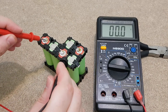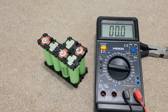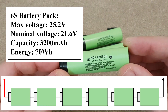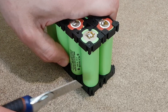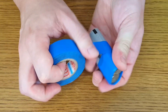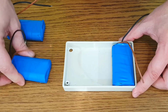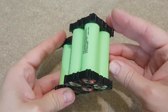This battery pack will have a maximum of 25.2V and a capacity of 3200mAh. The capacity may seem small, but remember this battery pack has 6 lithium cells in series with a total energy of 70Wh. In fake videomath, that's 19200mAh — wow. I'll remove all unnecessary plastic clips. The space is limited inside the box. Another option is to tighten the cells with electrical tape, which will make the battery pack a few millimeters smaller. But I prefer plastic holders for this project because I want some space between the cells so the cooling will be a bit better.